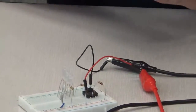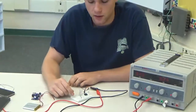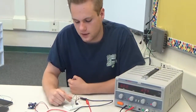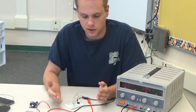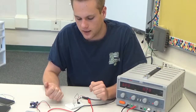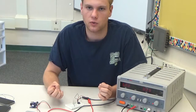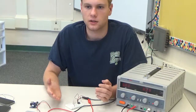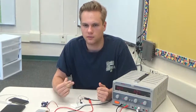The way it works is in each one of these plastic cases, there are three LEDs — a red, a blue, and a green LED. The reason why they seem to change color is because current takes the path of least resistance. Each of these LEDs will be brighter at certain points because more current will be flowing to them. The red LED has the least current, so at lower voltages it can be brighter.